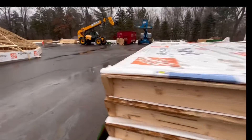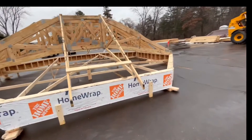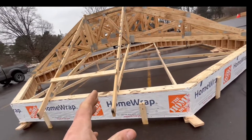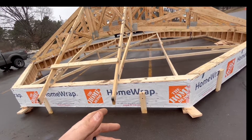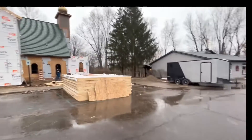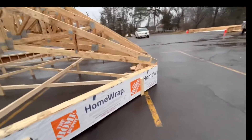The walls are like 12 by 18 feet, so all the stud layout on these knee walls is stacked on top of these layouts — it's all coordinated. The reason we did it this way is because we couldn't just build the roof system on the ground without setting it on something. We thought breaking it up into a smaller knee wall would be sufficient, so that's what we chose to do. You can choose to do it a different way when you build your octagons.